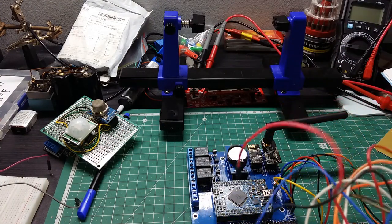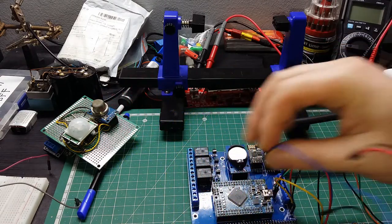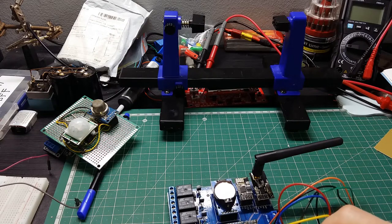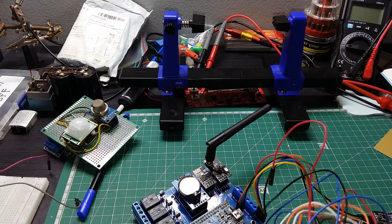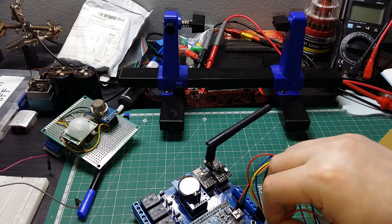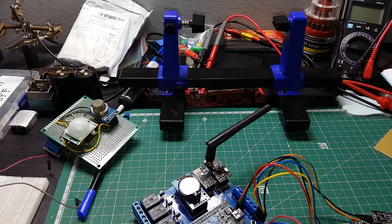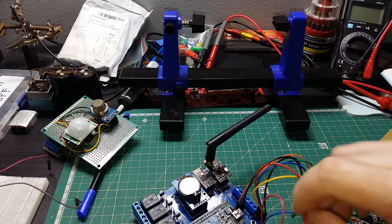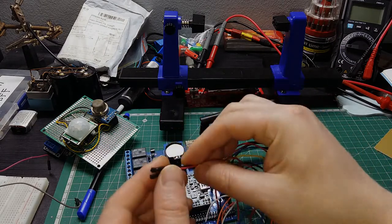if I go to hook up number 5, just this one to 11 on this board, which 11 is this one here. The next one, which is 6, goes to 12. Then I have ground and 5 volts there. It should come through these two.